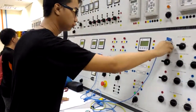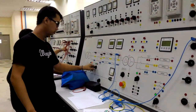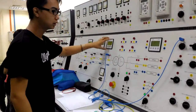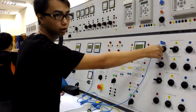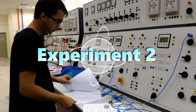Then we go to 25% and switch CB1 to close. We keep the reading here — this is the supply voltage and this is the load voltage. Then we will repeat the procedure with 25%, 50%, 75%, and 100%. Next we will go to Experiment 2.